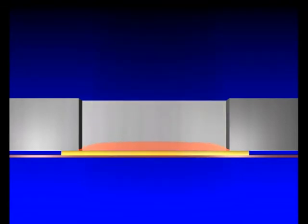The geometrical dimensions of the absorber surface are constrained by the size of the heat sink. Exposure to radiation yields a temperature profile that drops continuously towards the edges of the absorber. Thermal properties of the absorber entirely depend on its surface and thickness. Reducing the size of the absorber surface completely changes its thermal properties. The heat flow towards the edges clearly increases, and heating of the opposite resistor is significantly weaker, so sensitivity drops accordingly. Pressing a heat sink on the absorber will not guarantee perfect geometrical boundary conditions, and therefore the thermal properties are ill-conditioned. Constructing a miniaturized bolometer with high sensitivity is not achievable with such a device.